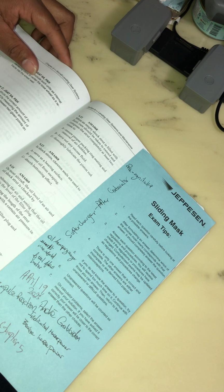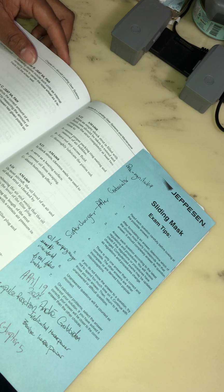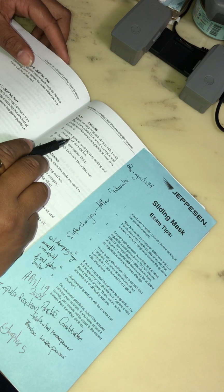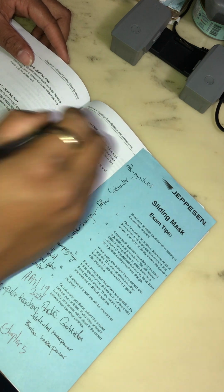When an empty shock strut is filled with fluid, care should be taken to extend and compress the strut completely at least two times to force out the excessive fluid. Thoroughly lubricate the piston rod. Ensure proper packing ring seating and removal of air bubbles.